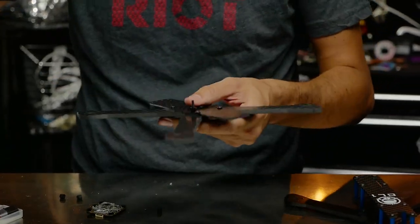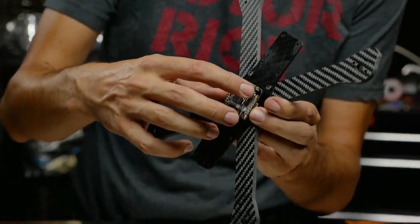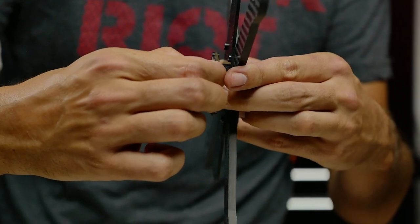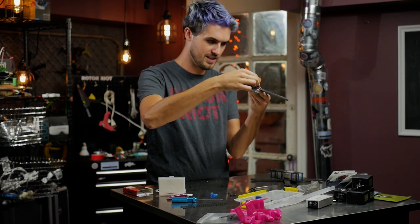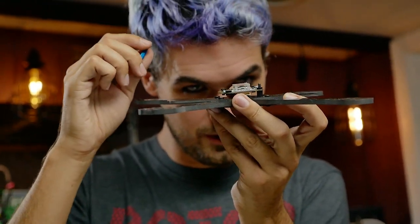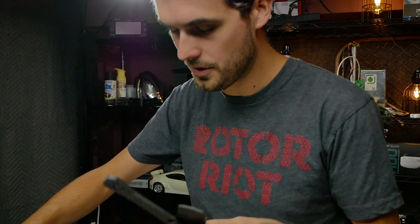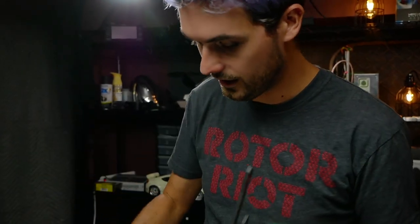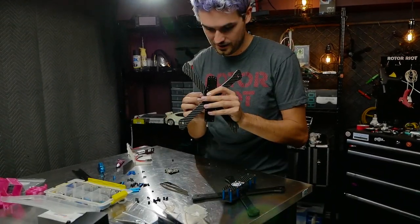You set the flight board down and drop a nylon screw on the remaining thread. Throughout the build, think about how things will fit together — you don't want a screw so long it interferes with the top plate. The stock standoffs are 30 millimeters so there's plenty of clearance. I'm using 16 millimeter screws: two millimeters through the bottom plate, plus three or four millimeters for the nylon, plus three millimeters for the rubber grommet, plus a millimeter for the nylon nut, with threads left over.